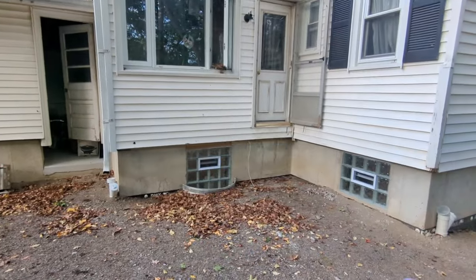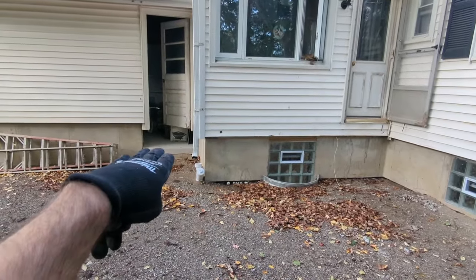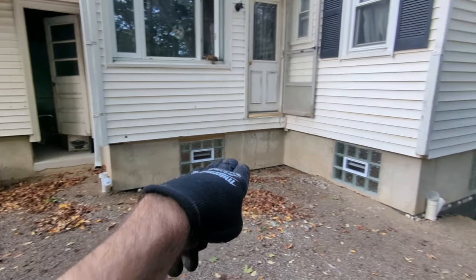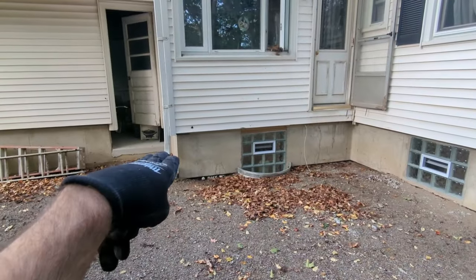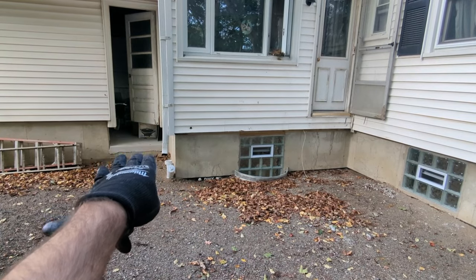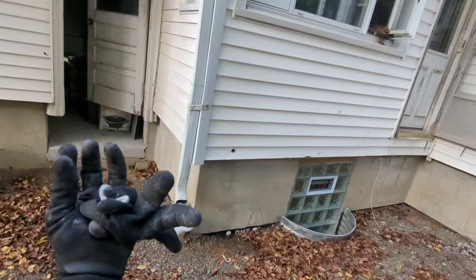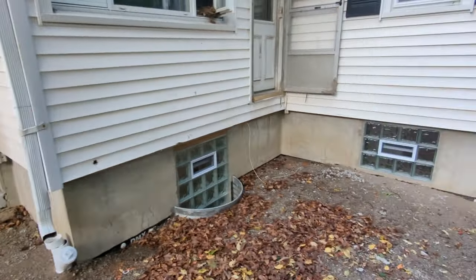There's also supposed to be a deck here in the future. If you go right up to this level, to the elevation of the bottom of the vent, then it's less of a step up. But that moisture can sit in that material and lift on that lip of the new garage floor and try to break it off by swelling and pushing up, cracking it. So I'd like to stay away from that situation.